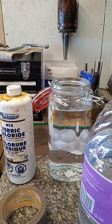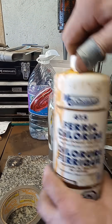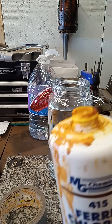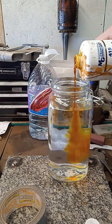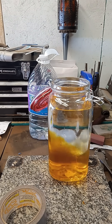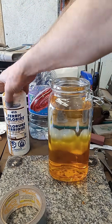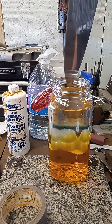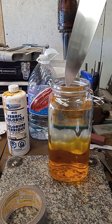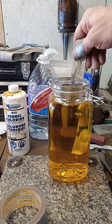The minerals in tap water are not helpful to a clean edge. We've got our concentrated ferric chloride, and we're just going to add a little color here — not much. Mine is a little more concentrated because it's been sitting around for a while, but it doesn't take a lot. You want a pretty light solution so that the carbon steel is etched and the nickel content steel is left less affected.